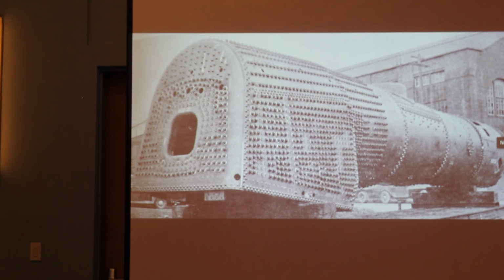Okay. How would you know if it was leaking? Would it be steam going into the firebox, or? Yes, there'll be steam, and every single time I've been around them, you'll hear it. Unless you're really working the engine hard, you'll hear it, it's quite audible. And it's like, hello, maybe it's time to take a look at this, but it's not going to catastrophically fail. There's all the other support.